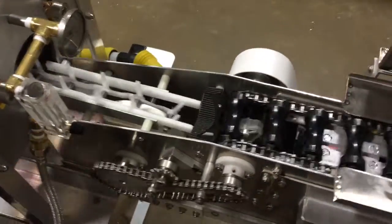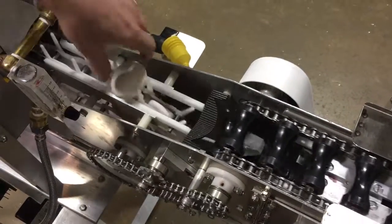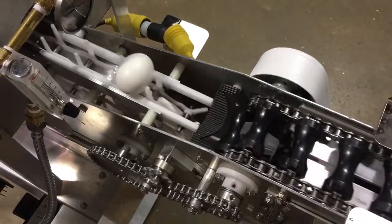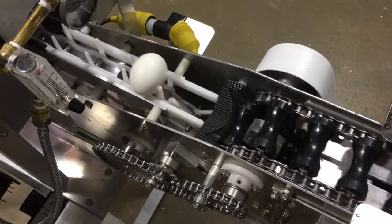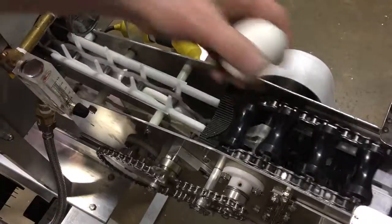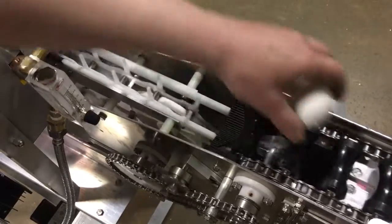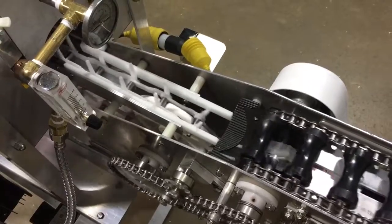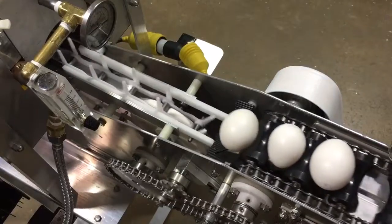Turn this on and try it again to see if we moved it far enough forward. As you can see now, the egg rolls onto the rails smoothly, and it is well onto the rail before the fingers come up behind it, which is what we're looking for in the transfer. That allows the egg to go across smoothly and makes it easy to keep distance between the eggs, regardless of size.